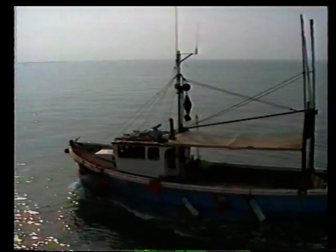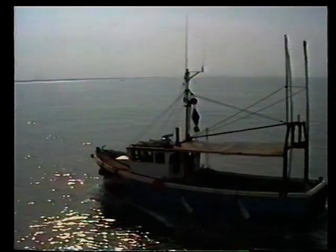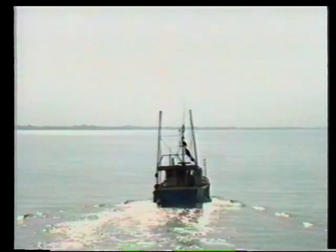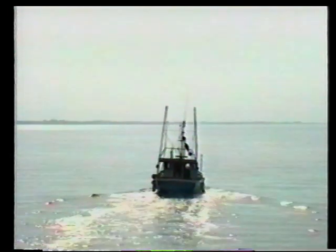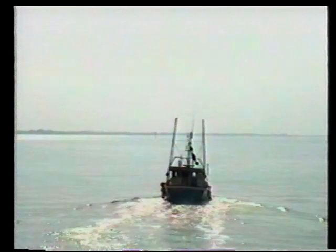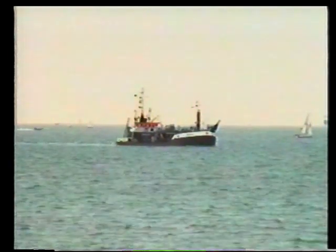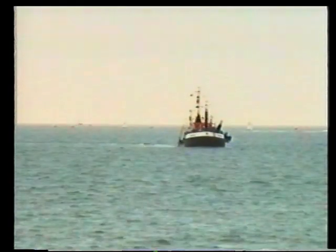Meanwhile, a new survey of the seabed is made. The large aerials on the survey vessels receive signals from navigation satellites and information on the tide height. This new survey will be loaded onto the navigation computer when it is complete. The saucepan has a speed of about 8 knots when she is empty and 6 knots fully laden. The journey from the dredge area to the beach takes about 15 minutes. As she approaches the beach, water is pumped from the hoppers to reduce the draft and ensure that she can run up as far as possible.